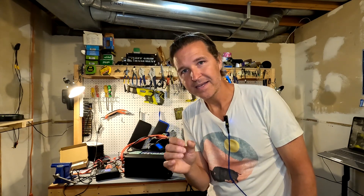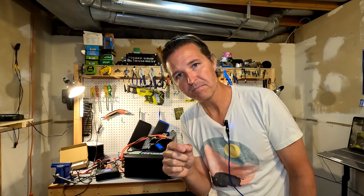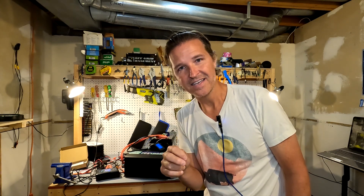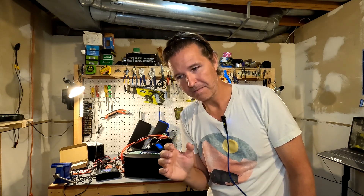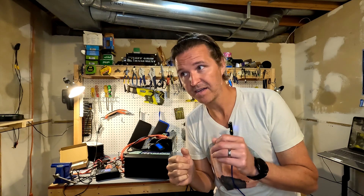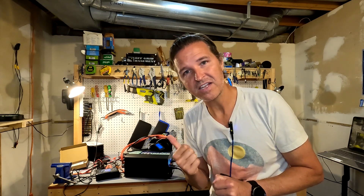It does exactly what you're buying it for. It doesn't have any bells or whistles — I do believe it has low temperature charging protection inside. There's a teardown video by Brad Cagle — I'll put his video in the description — where he finds a low temp sensor. You're not getting Bluetooth or anything like that, basically just the capacity. Based on the soak test and all the other tests, the capacity is good. It can run a large load for a while, so I'm confident it can run a medium or low load for years and years. Thank you so much for watching — if you have any questions about this XZNY 24 volt 100 amp hour lithium iron phosphate battery, please leave them in the comments.